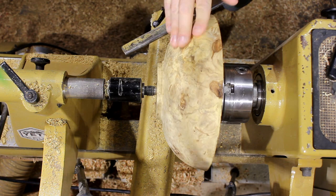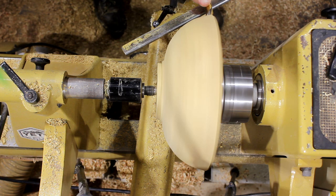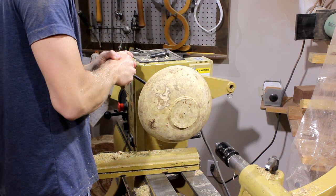Now I'm cutting on the rim again and I decided that was a bad way to cut with the tool, so I backed off and came back to a bevel cut. You can see the shavings coming out through that and they're very fine. Now I'm happy with the outside of the bowl — I only have one small bark inclusion which goes pretty deep, so I'm going to ignore that. Actually there might have been two of them at this point.